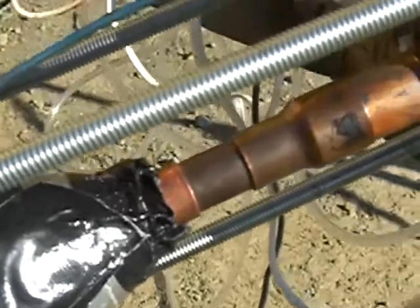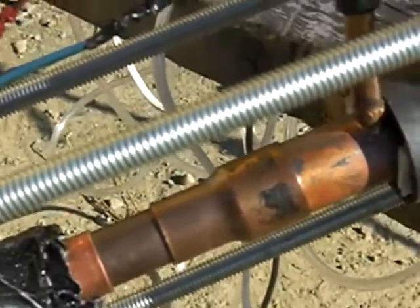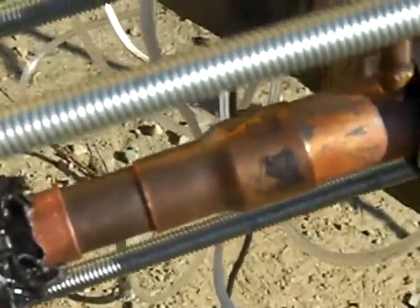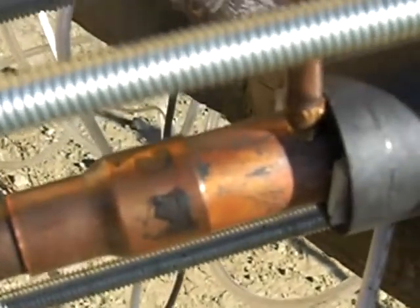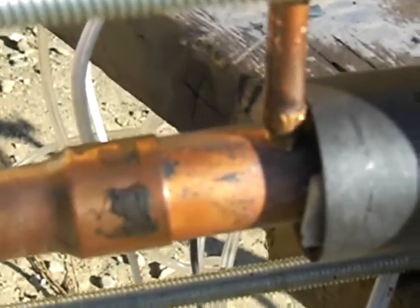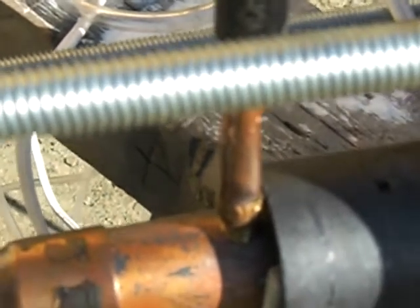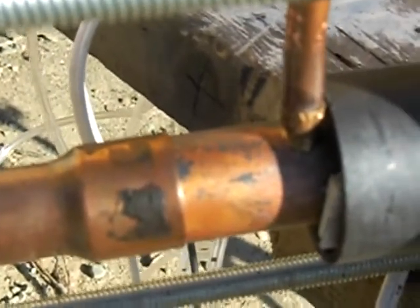You can see where I modified the end here. I have an inch to a three-quarter inch reducer there, so it fits onto the end of the funnel. The copper pipes are inside this one inch pipe. The propane is going into the air gap in between - the propane is going between the pipes, and the air is going inside the pipe. But ideally what you want is both the air and the fuel to go in the middle pipe, then come back between the two pipes.